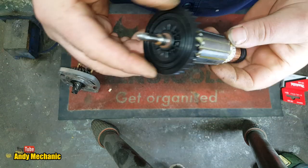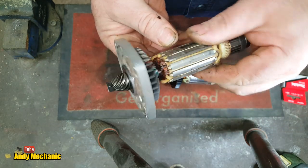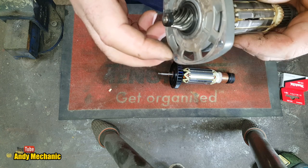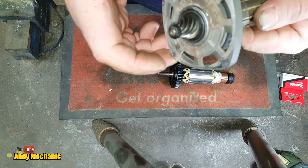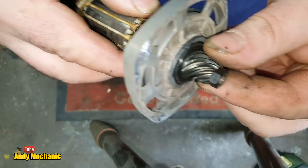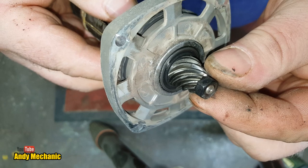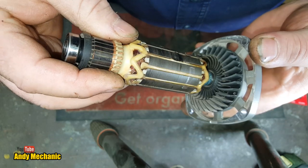First job is to remove that pinion from the old armature, so we'll put it in the vise - it doesn't matter if we clamp it on there because obviously this one is scrap. Hopefully the pinion will come off quite easily. Oh, it's got a chunk out of the teeth - and another chunk missing there too. It'll work, it'll work. What have you been doing with this thing? Can you see the bits that should be there that aren't there anymore? Oh well, I'm sure we can get a new pinion if we need to, but it'll work for now. That bearing's in good nick - no problems there.